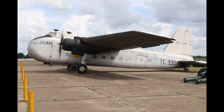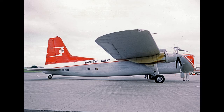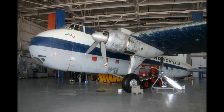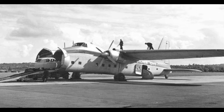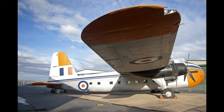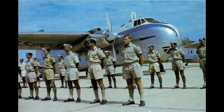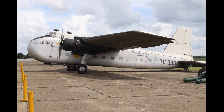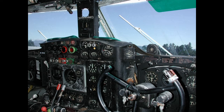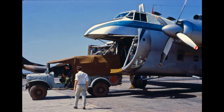As proposed, the aircraft was an all-metal, twin-engine high-wing monoplane based on the pre-war Bristol Bombay, having wings of the same section and taper but with a swept leading edge and straight trailing edge with two spars in place of the seven used in the Bombay. The square section fuselage was clear of internal obstructions; in the original design this was to be loaded via a trap door in the nose, but the Air Ministry requirements necessitated a change to clamshell doors in the nose. Considerable effort was made to maximise the usable internal volume to readily accommodate bulky cargoes. The flight deck was elevated above the load space on the nose so as not to obstruct access; the crew would enter the flight deck via a fixed vertical ladder on the side of the cargo bay.